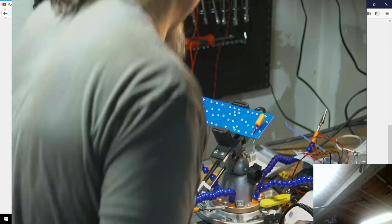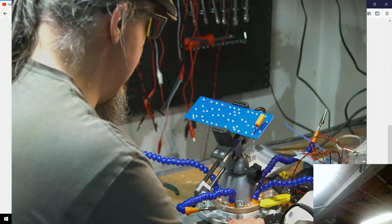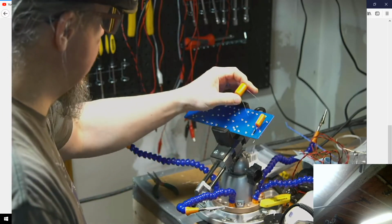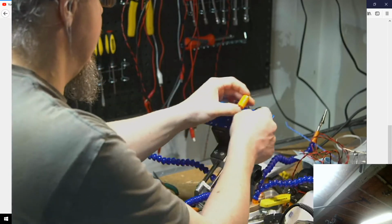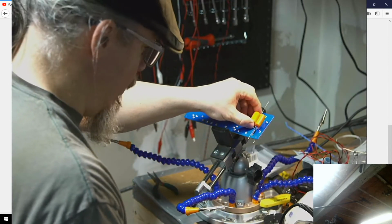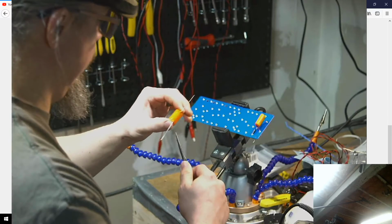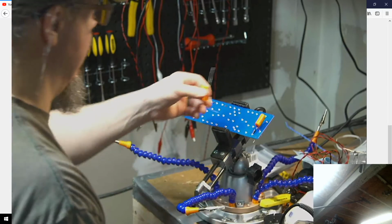So after I solder, I will go to the bottom and be snipping off some of those leads, but there's that one done. Next, we have the 0.01, and similarly to the same one here, this is going to want to go back to that previous gain stage. This one is going to go to one of the other tone controls as well, so I want that same black lead this way. So we will bend these guys, and then get our sense of where we want them to bend at. Where's my pliers? There. Of course it folded on me, but that's alright. So we'll drop this guy in. Oh, I went too far.